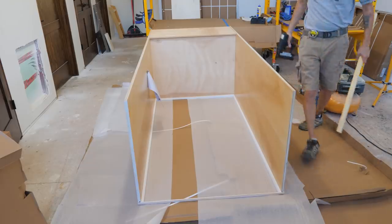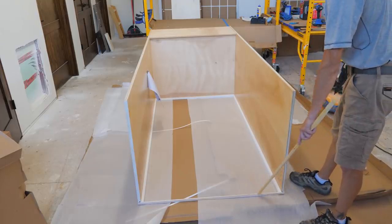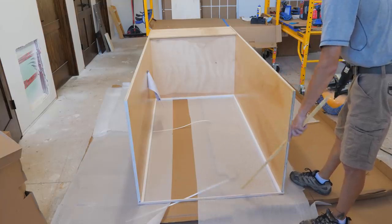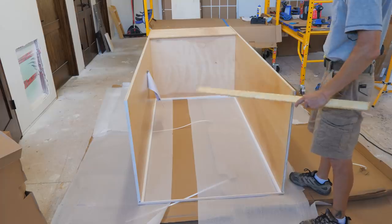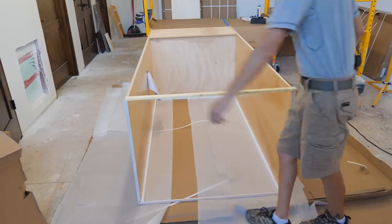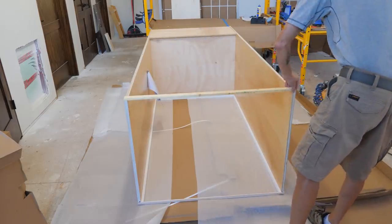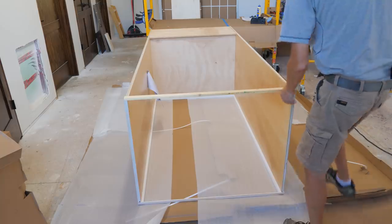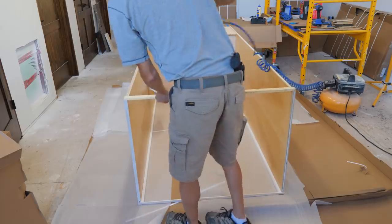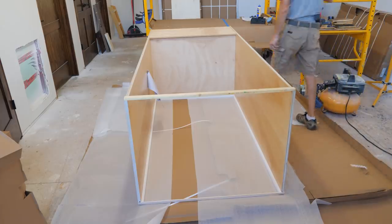All right, before I wrap up this fridge cabinet, you can see down here in the face frame bottom, they put a piece of material here just to kind of help keep that square, because there's no bottom to this cabinet. I'm gonna go ahead and take a piece of scrap and I'm gonna pin it to the back to keep that square as well, just until we get it maneuvered into its final position, and then we'll knock this piece off. So we're just gonna pin it right here. That'll give it a little bit of holding power so we don't break anything.